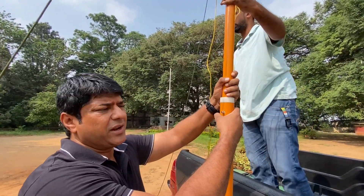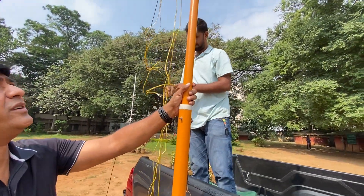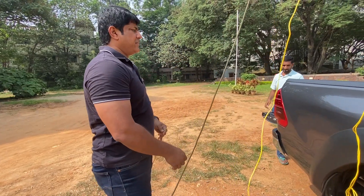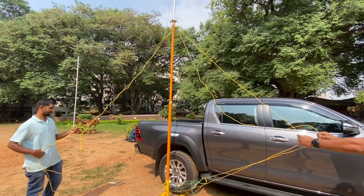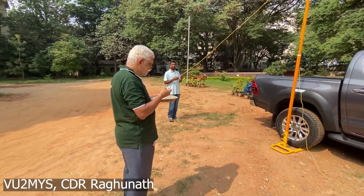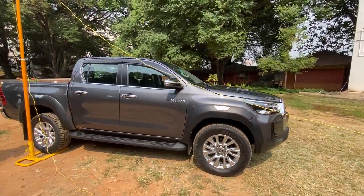It's locked quickly with pins and now we have the feed point at about roughly 12 feet above ground. Then you have the radials, which are 16 feet in length — four radials which are staked into the ground. And the guy wires again. That means you should have a correct earth. With correct earth, the impedance of the feed point is 35 ohms.